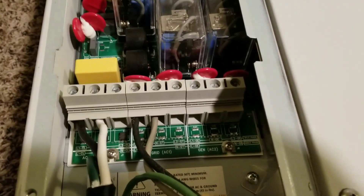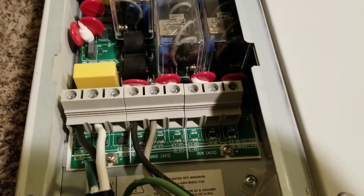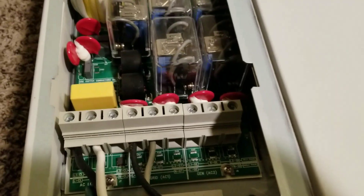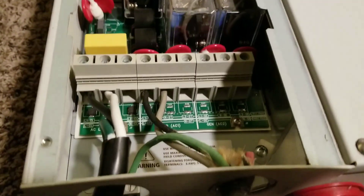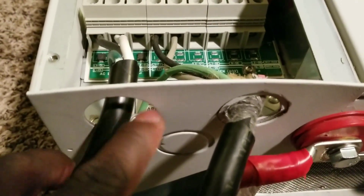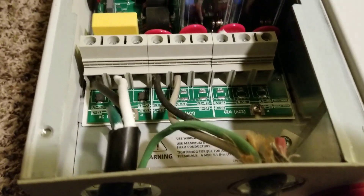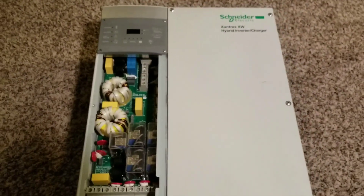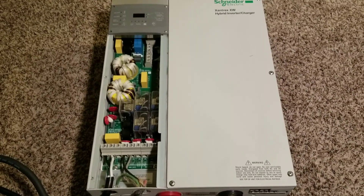You can do 120 or you can do 220 out to your breaker box, and 220 in to use the inverter charger to charge your batteries. This is just a demonstration — it's not all set up for permanent installation. I'm just demonstrating how you go about it — I even still need to put a knockout and strain relief here. This is how you wire your Xantrex XW 6048 inverter charger to AC out and AC in.